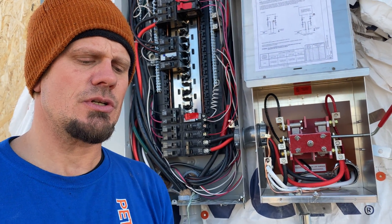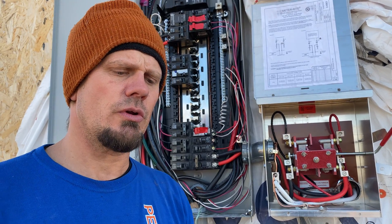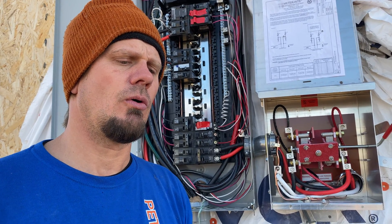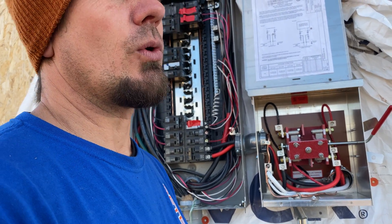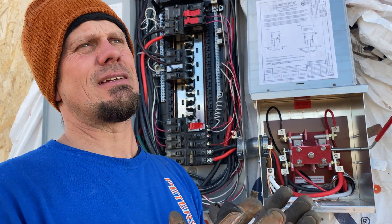A couple of things to keep in mind when you're outside: you do have to have a couple of breaker switches available, a surge protective device, your grounding and whatnot. This is a brand new home — it's 4,455 square feet. If I counted the outside eaves with all the Nora LED discs I've been wiring, it's probably more like a 5,000 square foot home for us. Biggest I've ever done. It's got 45 to 50 circuits in there.